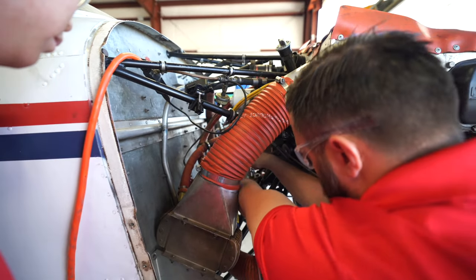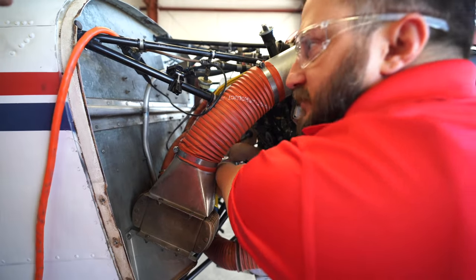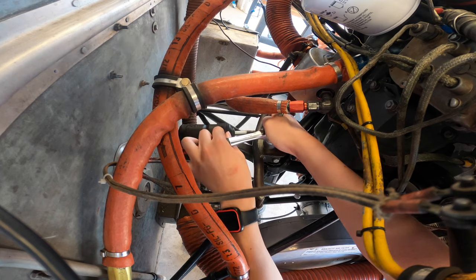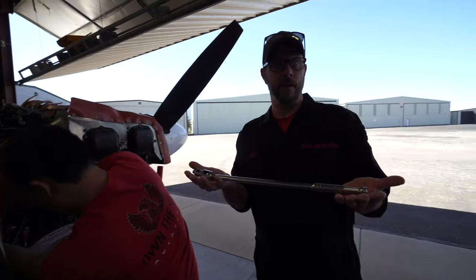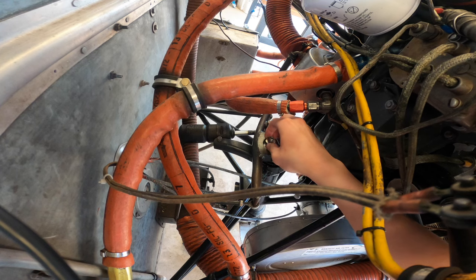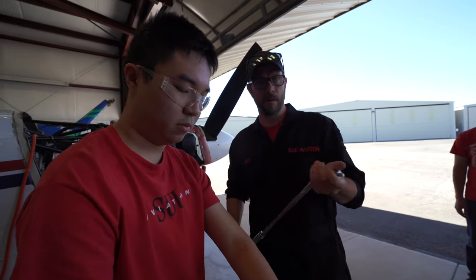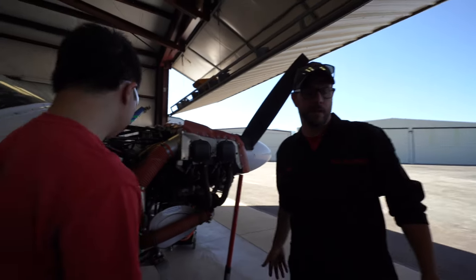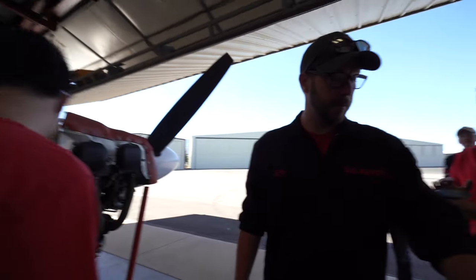And pull. Right, so you get in there, hold it on there, and then you can kind of pull. So use your leverage to your advantage. You don't want to bust your knuckles. This is your breaker bar. So in the event that something's being stubborn, this is the next step up from stubbornness. You're not going to break the threads, it just breaks it loose. But Jason actually is a He-Man in real life. Yes. So he managed to get it without a breaker bar.